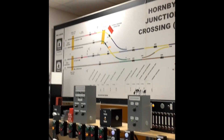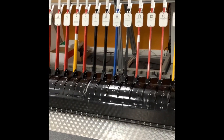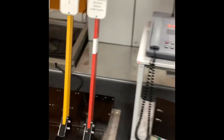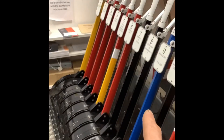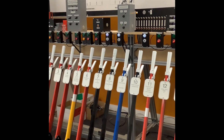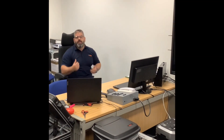Last time I saw this, it was in bits and pieces in the operations room at Stockport. This is a training simulator for Absolute Block. As you can see, there's a lever frame down here, all totally modular, built by a company - same as all the block instruments and all the indicators. The levers have no connections to the outside real world; they have resistance springs and plates in the back so that they simulate - in the case of points - the points being hard to pull. Seven, eight and ten points will pull like mechanical points, even though technically they're power-operated points. And the levers, even though we have semaphore signals, the levers will pull like colour light signals. There's no resistance, obviously, because there's no wire to pull - it's all electric.